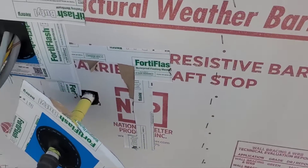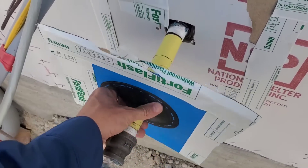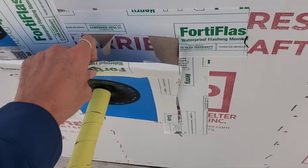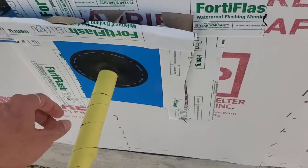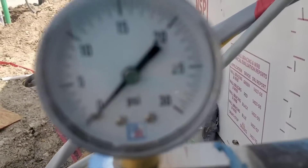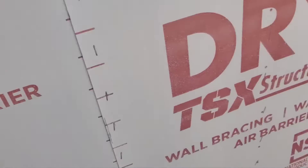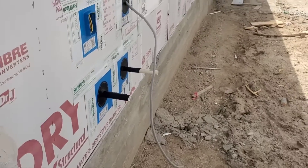Man, it's a nice little build. There's a couple things that have got me a little bit worried — some things that I don't see very often. We're going to start here with the outside. So this I actually see all the time — they've got their flashing here that's just completely cut off for whatever reason, so that needs to be fixed. Now your gas gauge is at zero, which probably means they've got a leak somewhere in the line. I'll make sure that goes on my report.